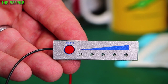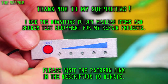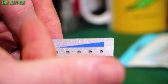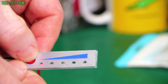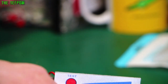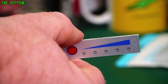It should work. So here's a close-up view — it's got 5 levels on it and you push the test button to bring it up. I've currently got my power supply running at 5.1 volts. It's just got 2 wires. Push the test button and you've got a red LED showing up. My lighting's really bright here so it looks quite dark on camera, but for me it actually looks fine. Let's increase the voltage — let's go 6 volts. Still just one LED. Let's go 6.5 volts, still one LED. Because it said 6.6, didn't it? Let's go 7 volts — oh there we go, we've got a blue LED.